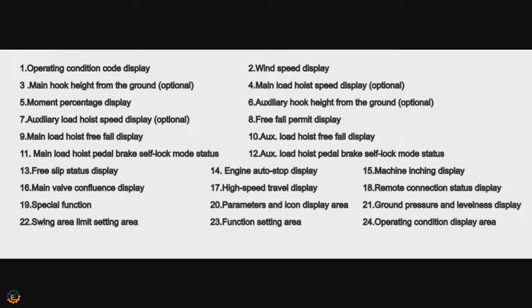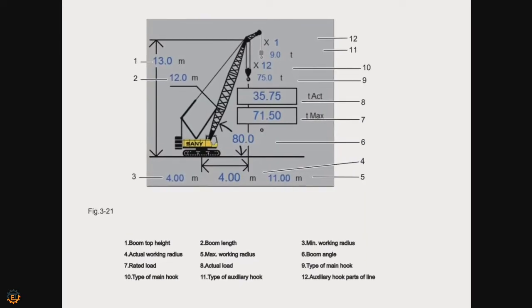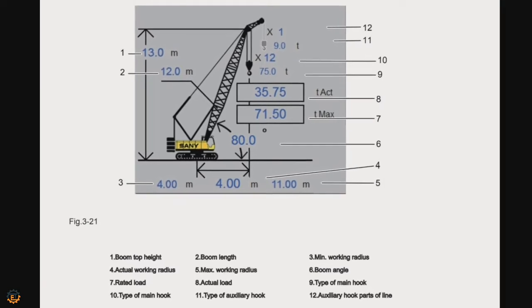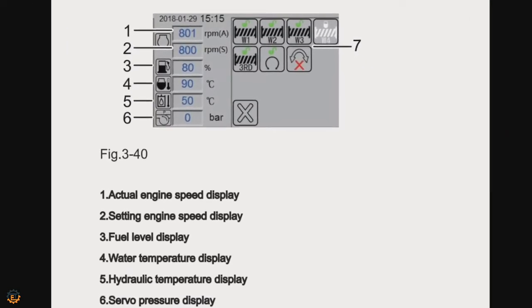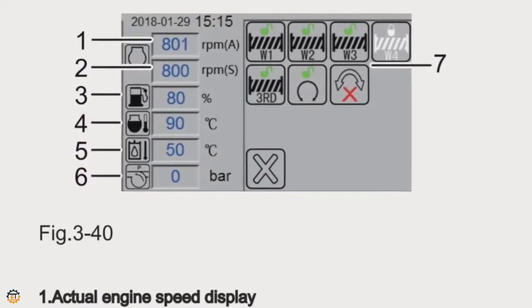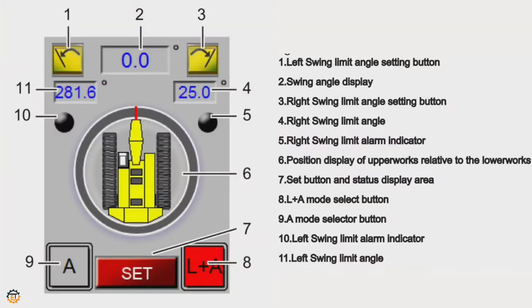We should say thanks to the SYMC and LMI control system. These systems control complete crane operations. If the crane moves towards a dangerous condition, this system makes a judgment and cuts off automatically. And it also performs as a black box to record all the lifting information.